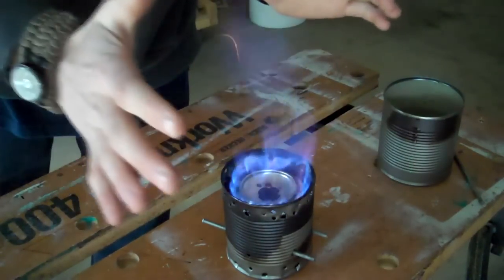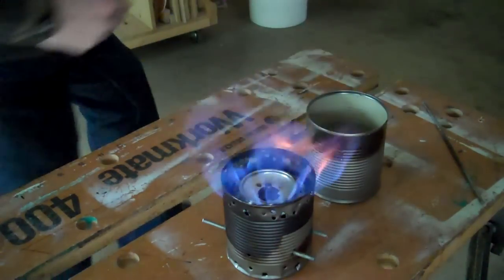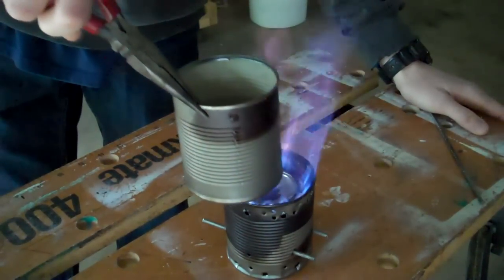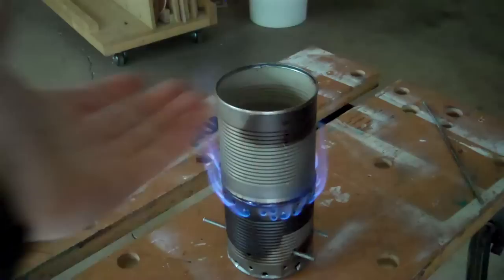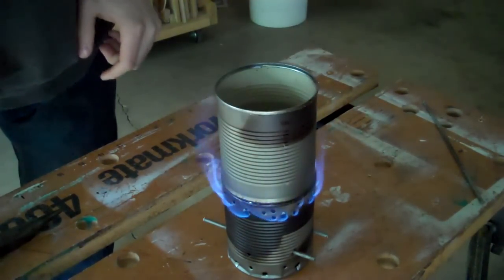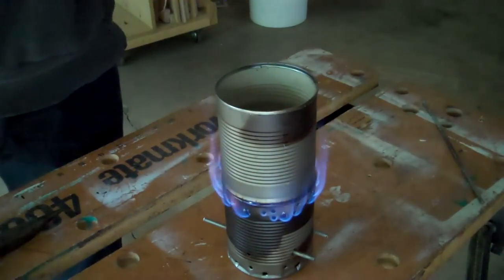It's burning pretty consistently now. This is a cup of water here, about room temperature. I'm going to grab a pair of pliers and slowly set it onto the top of the stove. That basically chokes out the top oxygen flow, and then when I finally set the cup on there, as you can see, all of the flames then shoot out of the burner holes themselves. Because of that chimney effect, it keeps the air burning out of the burner holes running just fine. Usually it takes a minute to warm up — sometimes I have to take it off and let it burn a little better. It's starting to burn very consistently now.